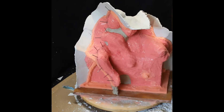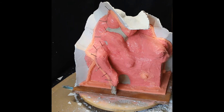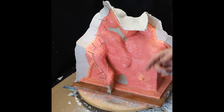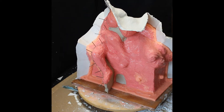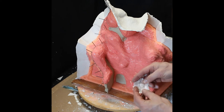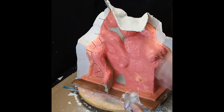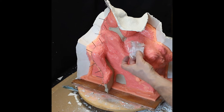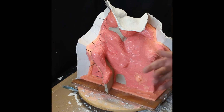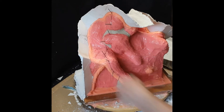After I put the clay on I'll grease everything up and start throwing some plaster on there. I'll do one layer of plaster, then put down the fiberglass cloth and open up that space a little bit. Then a second layer of plaster on top — it should be pretty good to go. Once that's done I'll have that all out and then I can do that last section.